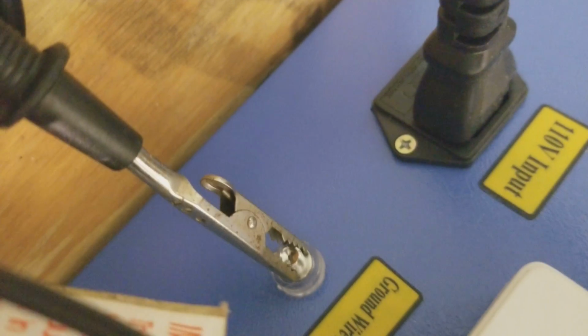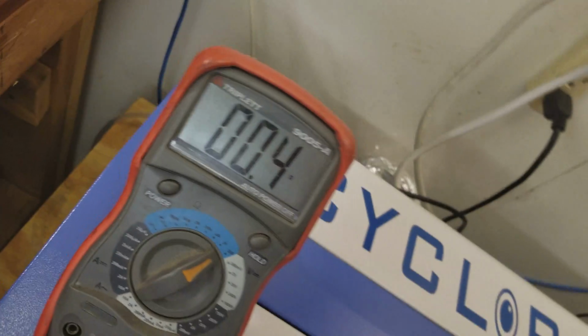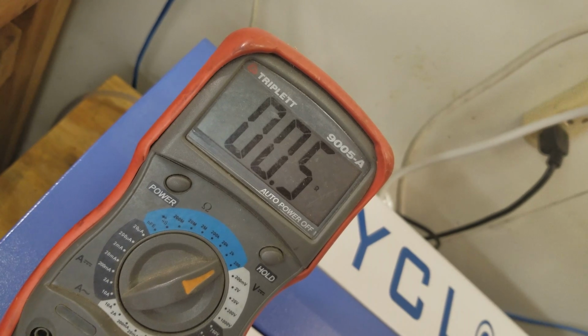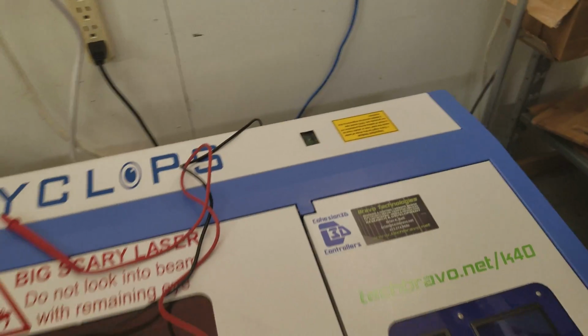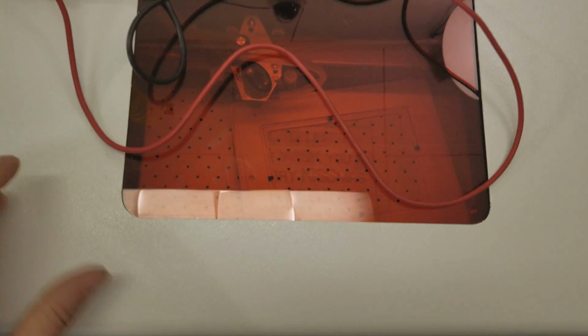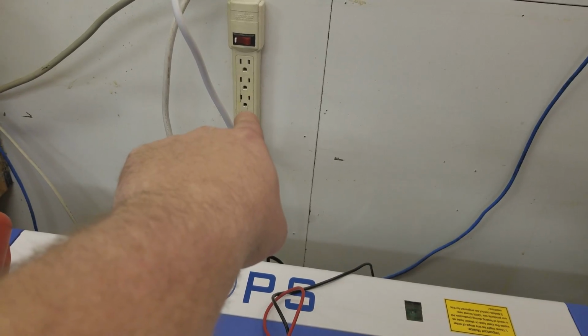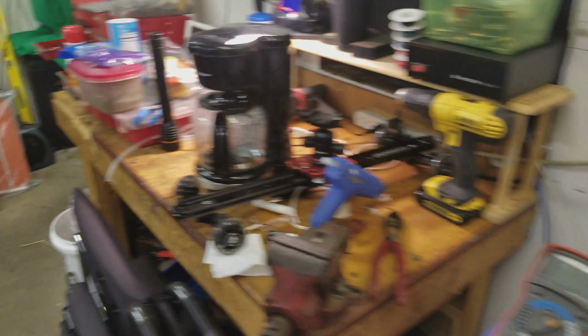Anyway, I'm going to reference that connection with it plugged in, power off, to this ground connection here, and I get about 4/10, half an ohm resistance. That's good. That works. I have effectively gotten an earth ground from my machine and the chassis and everywhere else to that where it's referenced, and there's zero potential between it and earth ground, or very little. So I've basically done the same thing as running that extra little wire.